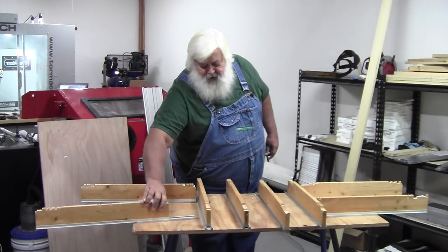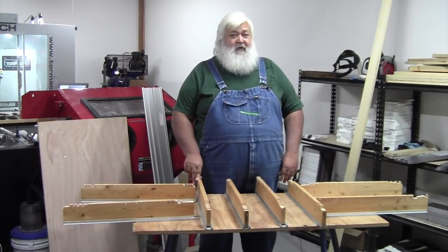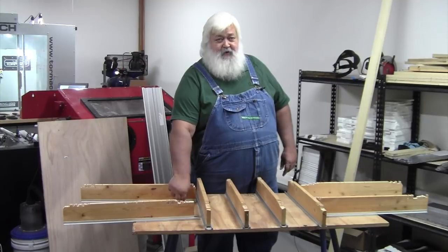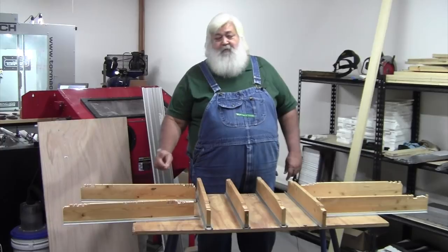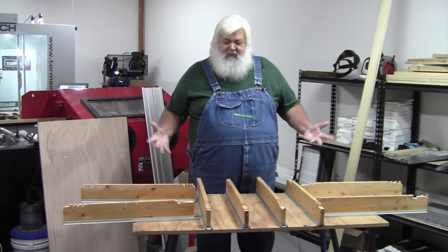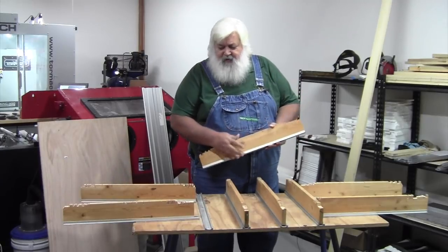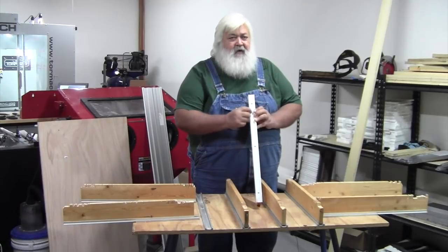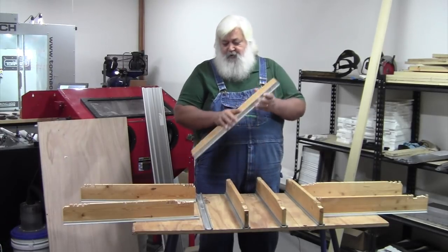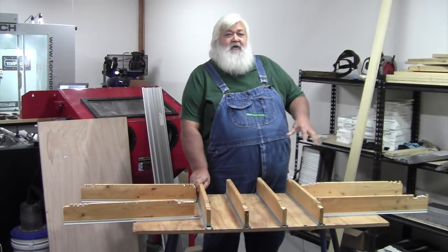So what do you get? As I said, 28 feet of aluminum extrusion and all the hardware. What do you have to provide? Number one, you've got to come up with the legs — we recommend saw horses. Number two, a good flat piece of two-foot by four-foot plywood, three-quarters of an inch thick. Your sacrificial pieces are simply one-by-fours, used in a two-foot section, though you can make them a little longer if needed. When assembling, down the center of each piece there's a line — that's where you drill your holes and put in your screws. We give you the screws; you supply the drill and drill bit. These are a special washer-head screw that supports everything nicely. And it doesn't hurt to put a little paste wax on this so everything glides a whole lot smoother.